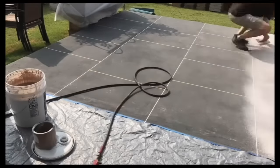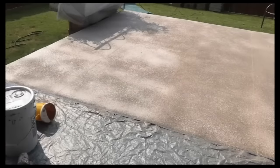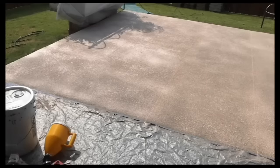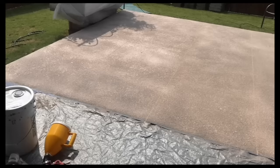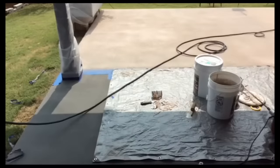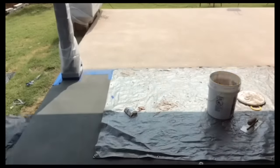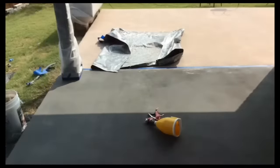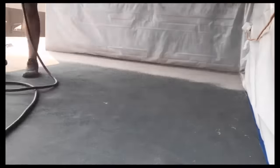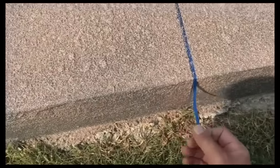I started at the far end. I mixed it first and developed just a little more texture — more randomness in it. I really like how it turned out. I was able to do two coats and texture everything twice to make it even. I used circular patterns as I did so. Here I'm mixing more — another five-gallon bucket. Here's the second coat. It sets up pretty quickly to the point where you can safely walk on it. I am now doing the main patio. I'll show you spraying it once — I knocked over the camera when I got to the corner, but I was able to put another coat on.